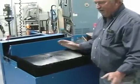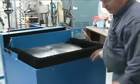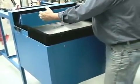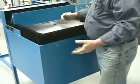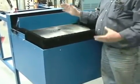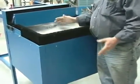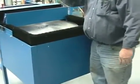Not only that, say you're doing big heavy stuff and there's nobody else around, you can have a foot pedal to kick on the machine or turn it off when you're working. Say you have a big piece and there's nobody to help you take it off, and the machine's running. You can release your foot from the pedal, it will stop the machine, and you can take the piece off without losing it. So those are different safety features you could have. There are so many things, but we recommend variable speed if you can afford it, because it's more money. But let me tell you, you're unlimited for what you want to do with this machine.